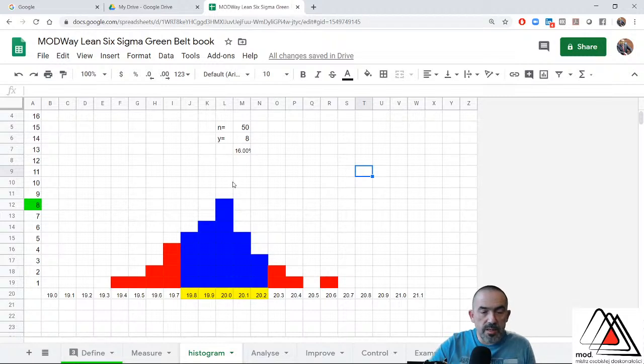So here, okay, why do our measurements have such a big deviation from 20? The 20 is the nominal value, and sometimes we are observing shorter or longer measurements, below or above. So every time we are measuring something which is not exactly our nominal value, it means that something has happened in this particular moment when my friend was cutting.